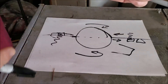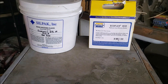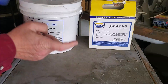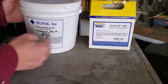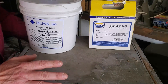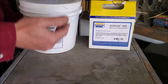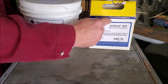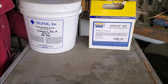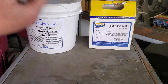Now let's talk about some basics of silicones. First and foremost, all silicones are a two-part mix — you have a catalyst and a base. One base rubber is tin-based and the other is platinum-based. Platinum-cure silicone is extremely finicky — molds made from it will last longer, but platinum-based silicone is affected by heat, humidity, cold, and all sorts of different chemical reactions.